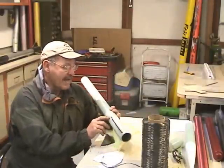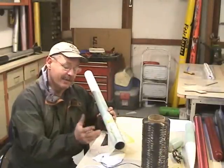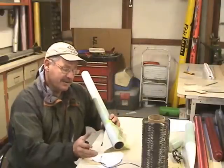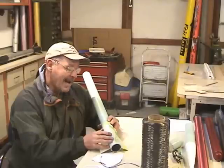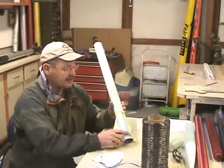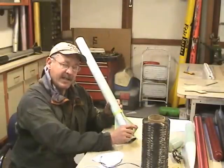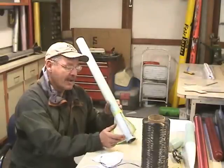The kit is pretty cool in that it has slots for the fins to go in, which adds a lot of strength — the fins are not going to pop off or come delaminated. So I'm doing just a quick two-layer application with pretty thin fiberglass, going up a couple of levels. That strengthens the root edge where you have a lot of span. As you get closer to the tip you don't really need that strengthening; the extra thickness would actually hurt altitude.